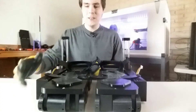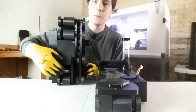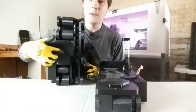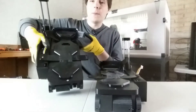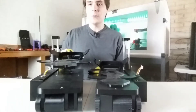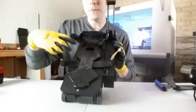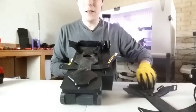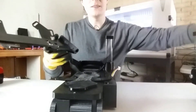Here are the new shoes. They go forward and back and the motor is back here — turn the motor and all the wheels turn. The gear train runs along the whole length, and here is the speed controller and anti-spark switch. Over here is the battery and the microcontroller, and the binding is on the top, same as the other shoe. The shoe stays on the ground, the binding comes up and rolls on the wheels. Something you may have noticed is that the binding is kind of funky shaped — it was a long straight rectangle before, and now it's wider in certain spots.